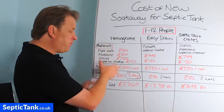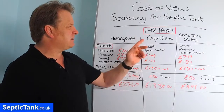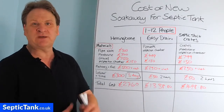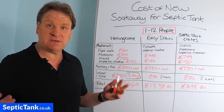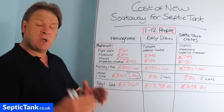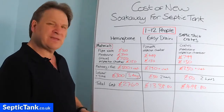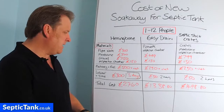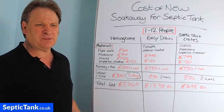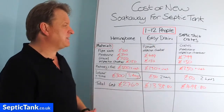Personally, I'm going to be biased here — I've put many herringbone systems in, but I lean towards other soak away products now. Many drainage firms lean towards easy drain and septic tank crates because they require no gravel, take only two hours, meaning you can get onto one job with a couple of men and move on to another literally within a day. I'm not demonizing the old herringbone system, but they're a thing of the past — they were popular in the 50s, 60s, 70s, and 80s. People who install them now simply don't know about easy drain or septic tank soak away crates.